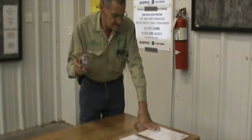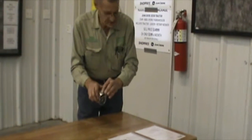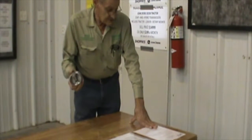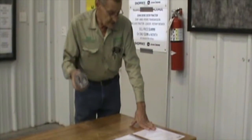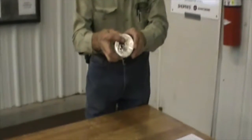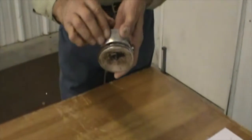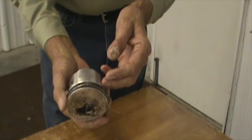The questions on this piston: it's got a little bit of scoring on the skirt, just slight scoring. The first one is the scuffing or scoring on the piston could be a cold start with immediate maximum throttle, and this is absolutely true. The second question, the arrow stamped on the top is indicative as to the direction that the piston should be pointed, and that is also correct. The wear pattern on the skirt of the piston could be caused also by dirty oil. This is also correct.